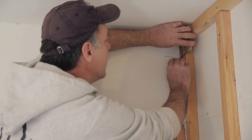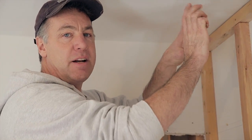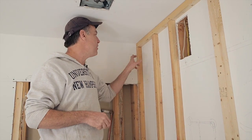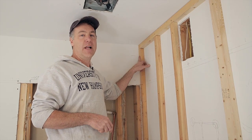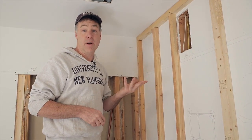I'm marking the corners because you have the ability to roll your material to make your joint fit tighter. Keep in mind that with sheetrock on framed lumber, surfaces are not perfectly flat, level, or even, so we're going to have to adjust to the room. These marks will be a reference point to shoot for.